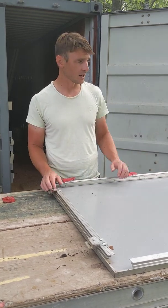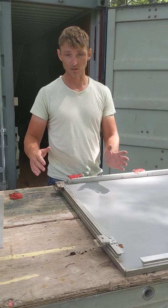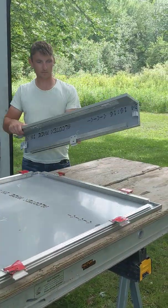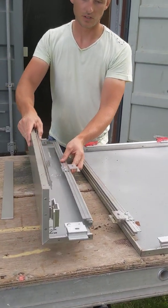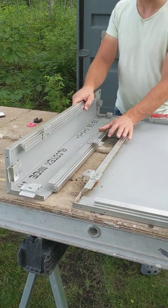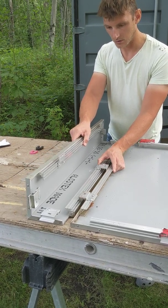I'll show you how the two panels fasten together. When you've got these clips on, you want to be mindful of where you're putting the clips on this panel relative to your next panel so that they can fit together. Here's our next panel. You would install this one like this — you'd be installing from the other side. This gives you an inside view of how it gets installed. You see here we put one clip in the middle, and these two clips will also lock into this panel — it locks in like that. Make sure you're locking in.